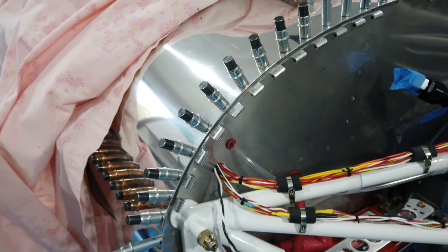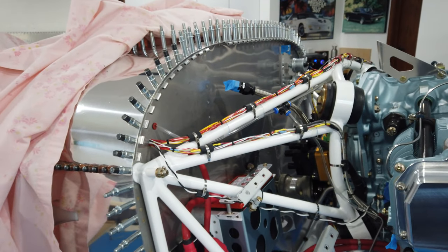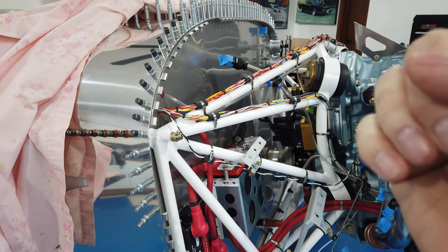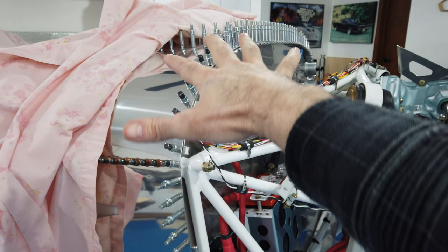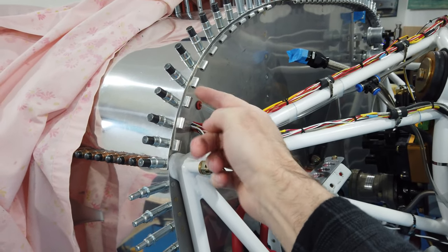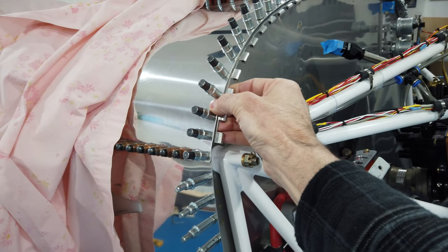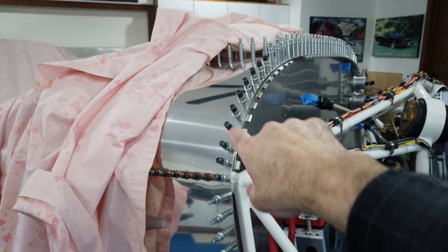You can see I've got full knuckles again — a full knuckle here and a full one here. Now I'm going to shift gears. Fitting these hinges is so I can fit the top cowling, which ultimately means I can fit the bottom cowling. This top skin and all this hinge work is only held in place with clecos, so there's potential for a lot of movement. The clecos don't pull everything down as tight as a rivet, and there's a pretty good stack-up here — a thicker countersunk hinge, a thinner dimpled shim, and then the thin dimpled skin.